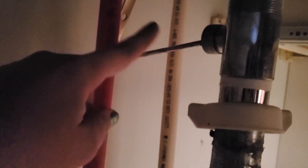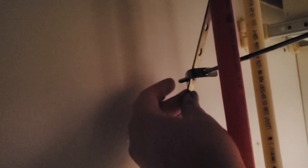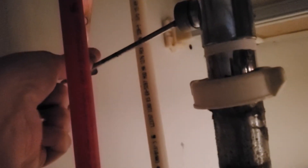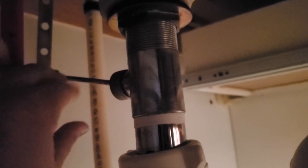Back here you've got this little bar that goes into the drain and then it connects back to this little metal piece. This is what holds your actual drain stopper and pushes it up and down. When it is down on this side it's actually up in the sink, and when it's up on this side it's down in the sink — basically it's connected here and it pulls it up and down.